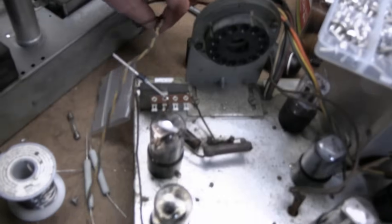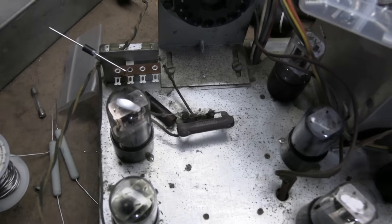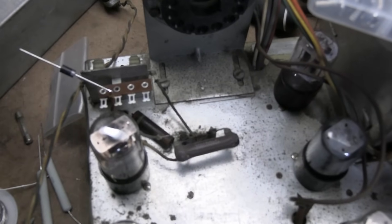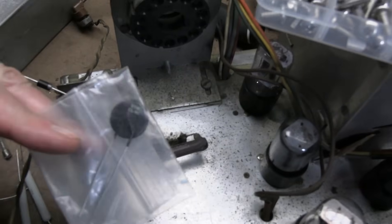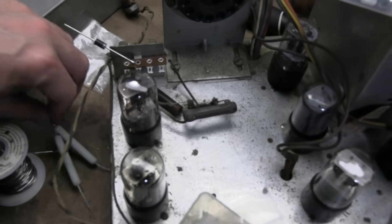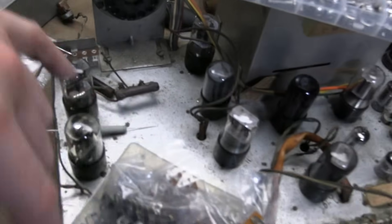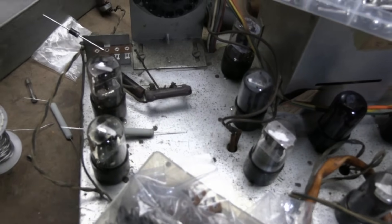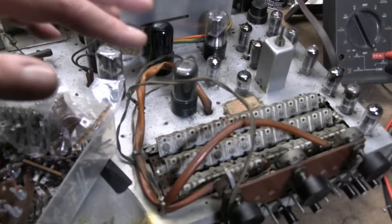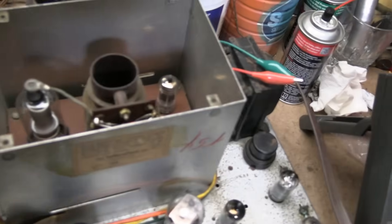But I'm also going to do something else. The set has a fuse — here's where our line comes in. One wire goes directly to a fuse holder; the other goes to ground the chassis. They put the fuse on the ground side, which is fine. But what it does is give us a great opportunity to install an additional device. We're going to cut this wire and slip in a CL90 thermistor to provide a soft start for the entire set. These 18-ohm resistors are in-rush current limiters but they're fixed resistance, and they're only in the B-plus side. All the tube filaments are wired in series going right to the AC line — no buffer, no in-rush current limiter like you'd see in a Motorola VT71. You may recall when I first powered this up, the 6L5 in particular flared up kind of bright, and the tube in the high voltage box — I think it's a 6C4 — flares up when I power on the set too.